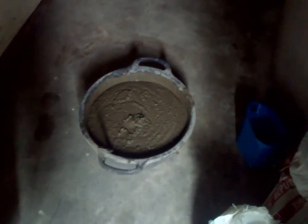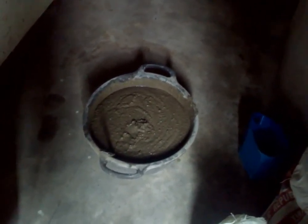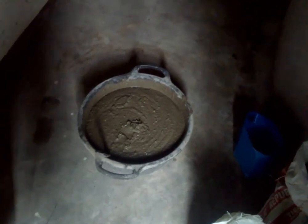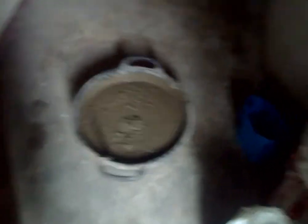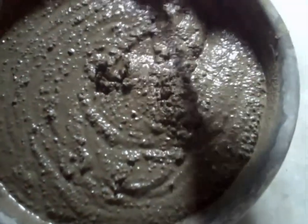I'm going to give you a little bit more information here. When you mix up your cement — 50% sand and 50% cement — and you mix it inside your container: if you're doing a small project, you mix it in a little container, but if you're doing a big project, this would be entirely too slow. What you want your cement to look like is a cake mix. When you're mixing, you want your spoon to go right straight through — easy mixing, like you're doing a cake.